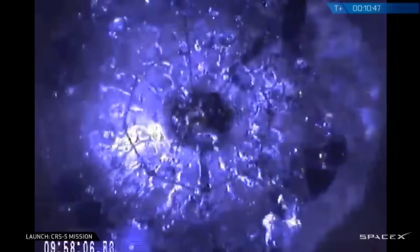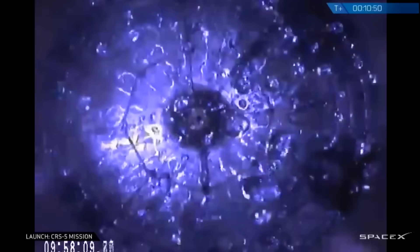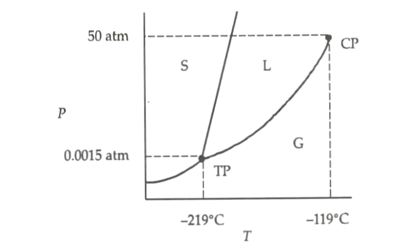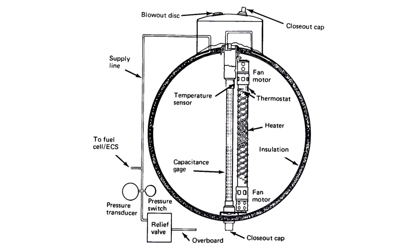A supercritical state is where there's no transition from liquid to gas — there's no surface that forms, no bubbles or droplets. Compare this to regular liquid oxygen seen floating around in zero-g after a rocket reaches orbit. Supercritical fluids are good because you get consistent fluid flow out of those tanks when you drain them, and it makes it easier to measure how much oxygen is in the tank. The downside is that supercritical fluids need very high pressures — in oxygen, about 50 atmospheres. As the oxygen was consumed, the pressure would drop, so to keep the pressure up, the tanks contained electrical heaters. The temperature inside the tank would still be cryogenic even with the heaters running. The heaters ran along the length of the tank in parallel to the capacitance sensors used to measure the tank fill.